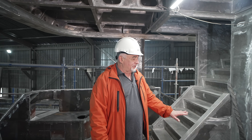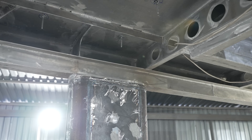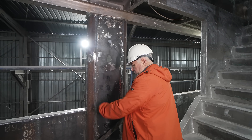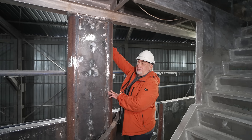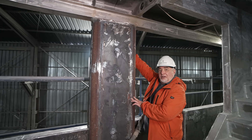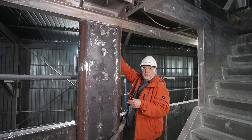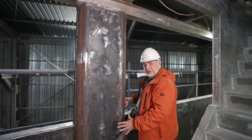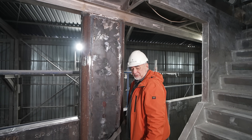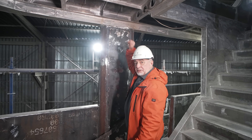It's a very common method, but a lot of people ask how you attach aluminum to steel — and here is the answer. Here is another very important detail: this is the ventilation shaft going straight to the engine room, with the vent located about three meters above the waterline. At no inclination in pretty much any sea condition is it hard to reach this point, so it's very safe. It's a very straight shot — a very good ventilation system. Very important to have it as high as possible, not under the deck.